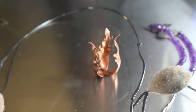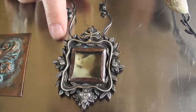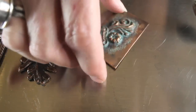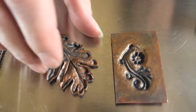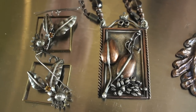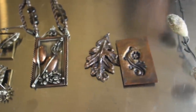I generally don't do a lot of just chasing or just repoussé, but I probably do less chasing. This piece is strictly chasing — there's no repoussé — and you can see the little marks made with the chasing tools. It's kind of like an almost engraved look. These pieces are a combination: this was a practice piece for raising up the metal pretty high, done with repoussé and chasing — you can see the tool marks there on the back. This leaf is both chased and repousséed, and then sawn out. Some finished pieces have very little chasing — I chased the center line to set the silver wire into. These earrings are both chased and repousséed. Those are some examples of what we're going to be covering in our video today.